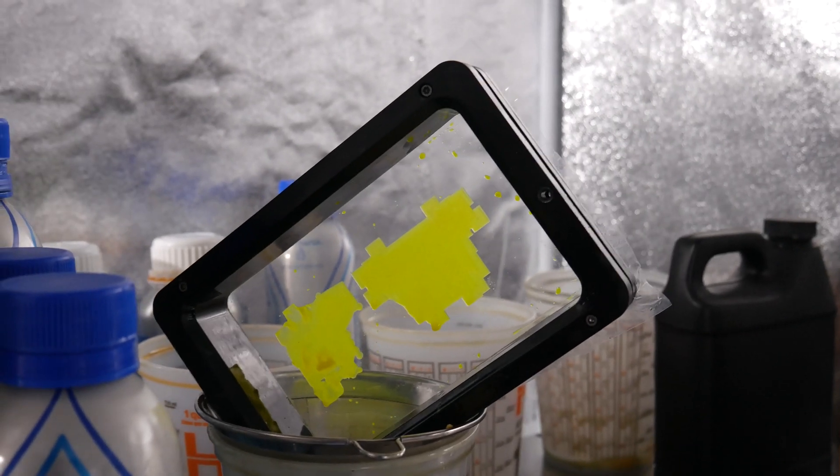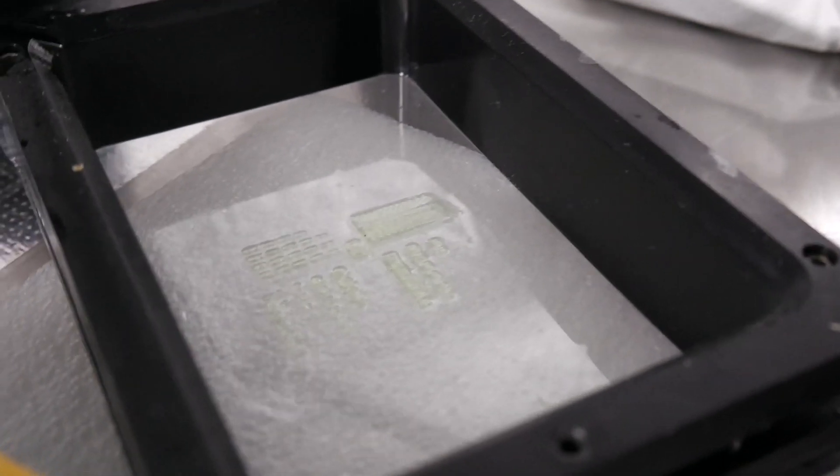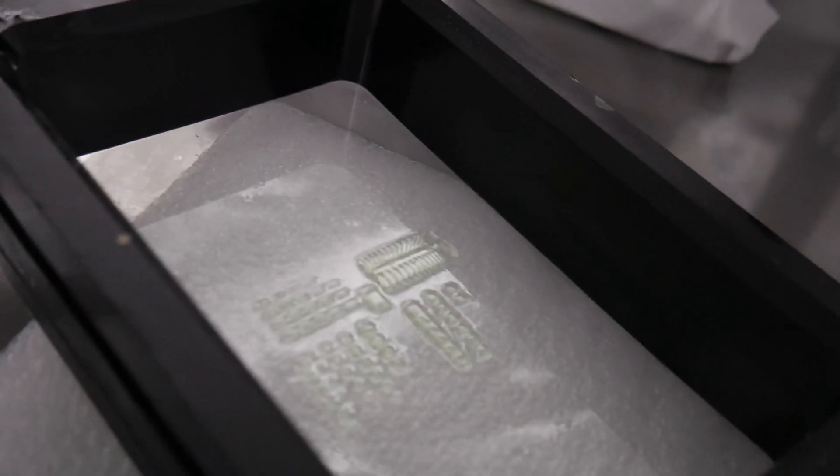That being said, even with a thin 100 or 120 micron FEP liner, you can take a few different steps to greatly reduce the risk of a catastrophic puncture and leak. These are tips I've figured out from my own experience. The first thing you will want to do after every single print, regardless of success or fail, is filter your resin. Because after every print, there's always a chance that your vat has been contaminated with little bits of partially cured resin that, if left in the vat, can be pressed into the FEP film, potentially piercing the FEP as well as damaging the LCD screen. In my experience, this is usually the most common way that FEP sheets get pierced and leak.